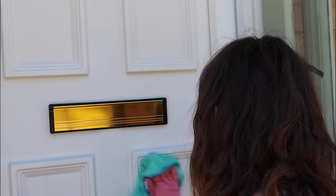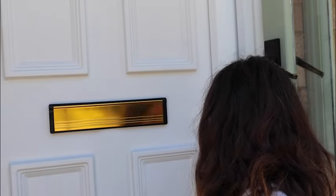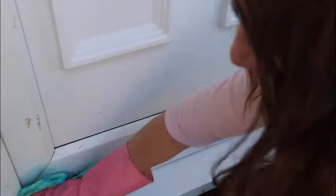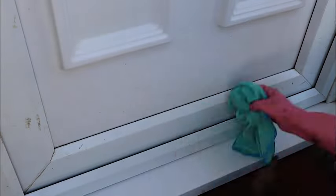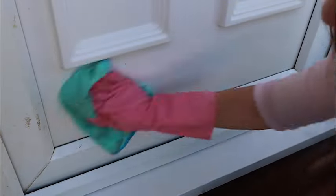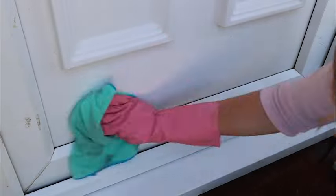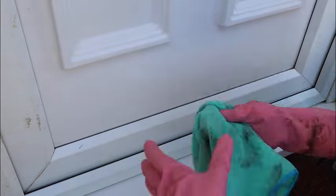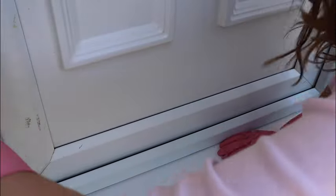It's a good idea to do any painting when you're not in direct sunlight, as the sun dries the paint more quickly and it's going to be harder to get a nice smooth finish. On this day I waited for the sun to go around the side of the building. As this is an inner door with an outer porch area, the door isn't in direct contact with the elements so it won't get rained on, but it does get sunshine in the morning.